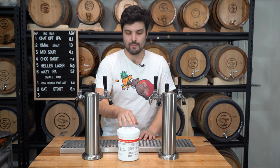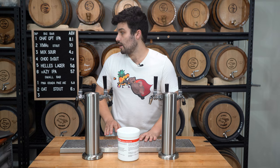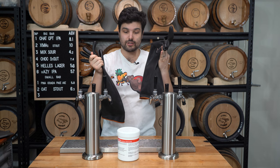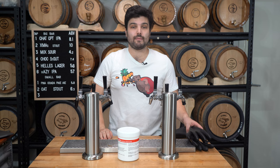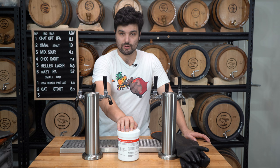First disclaimer: sodium hydroxide is extremely dangerous. If you are going to use this product, you need to be using big thick chemical-resistant brewery gloves, because regular household cleaning gloves are just not going to cut it. This stuff is an extremely strong base — it sits at pH 13 on the scale — so it is very corrosive and very dangerous to use. But that also makes it an extremely powerful cleaning agent; used at about 20 grams per liter, it will strip all debris.